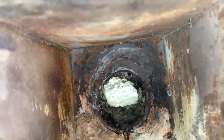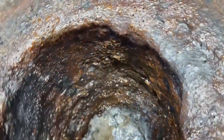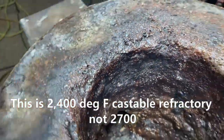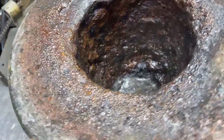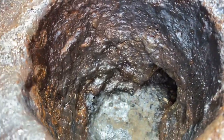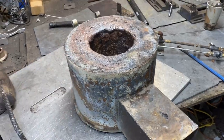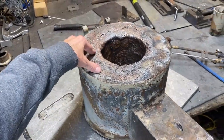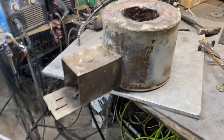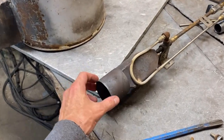I don't know how much I'm going to chip out, but this is what happens when you use 2,700 degree refractory for a long duration of time at 2,700 degrees. It's very porous, but nonetheless it's holding up. Anyone who's ever tried to make one of these things knows they do fall apart after a while, so to get one to last for 30 burns and still pretty much be held together — the purpose of this whole thing is this burner only gets us up to 2,650 degrees on average, so with this new burner we're hoping to achieve 3,000 degrees.